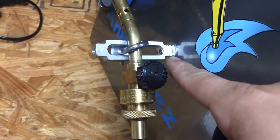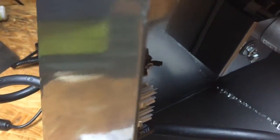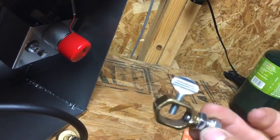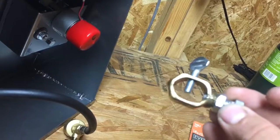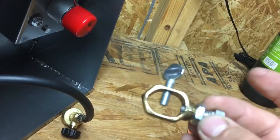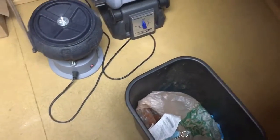Really simple: a bolt with the head cut off goes in on this side with one washer, and on the other side another washer and a wing nut — so you have adjustability without needing any tools. With the original torch holder you had to break out a half-inch wrench every time you wanted to adjust it. The tilt-only adjustment would have been a nightmare for annealing different lengths of cases, so that original design is trash.